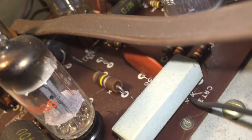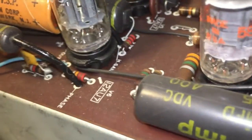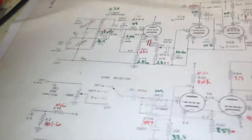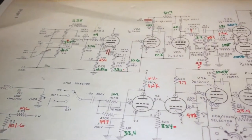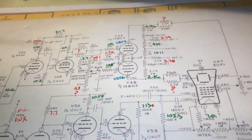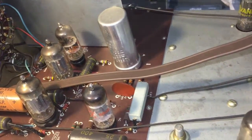I'm also going to point out, because I saw it in another video, that there are no rounded resistors in this unit. All the resistors have a sharp, squared-off end. I've gotten now to what I'll call the second level of the schematic — all roads lead to the CRT, until such time as all roads lead to the power supply. I'm finding a higher than expected failure rate for the resistors. Not a big deal, just more work to do. I'll swap them out as necessary, but this is why this is done. Don't simply just do a recap job — that's not sufficient.